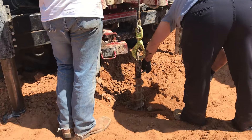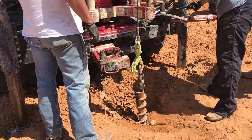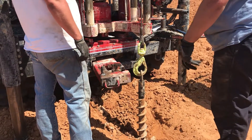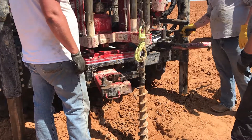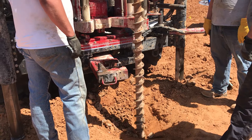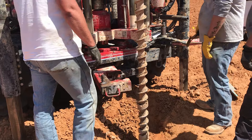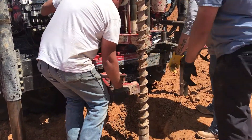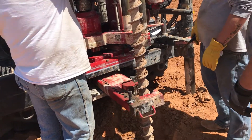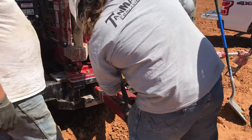The driller uses a hook on a hydraulic winch to pull the string out of the hole. The derrick moves in and out on a rack. Below that, you'll see the hydraulic backup tong come into play — it holds back as they unscrew from the string and also acts as slips to keep the pipe from slipping back down into the hole.